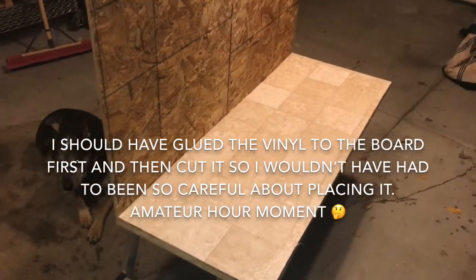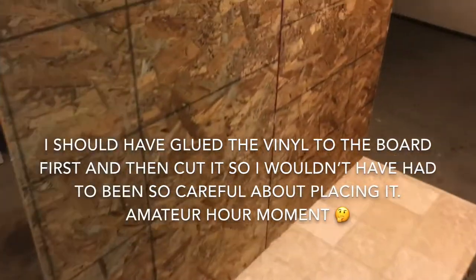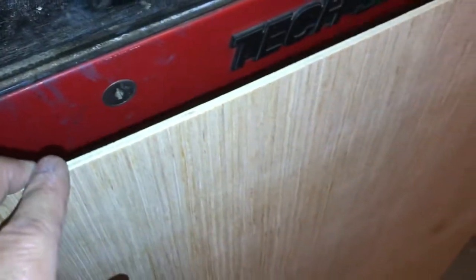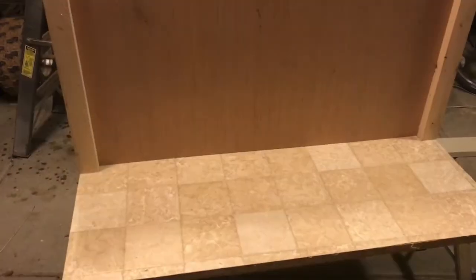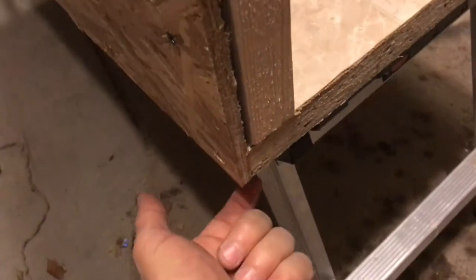Keep in mind I am just trying to use stuff I have - I've got a bunch of miscellaneous woods so I'm just using what I've got for this stand. I put two pieces of backing since I didn't have enough for a full piece at 49 inches wide, then I'm going to put a quarter inch nice finished wood over that and just glue it and put a bunch of brad nails in there. I added some corner braces - basically 2x3s - threw some tack nails in just to hold it, then added three screws and a lag screw from the bottom.